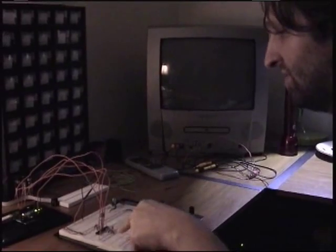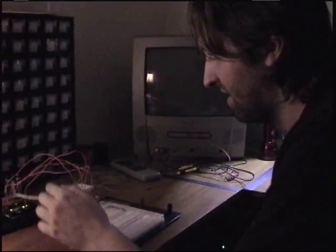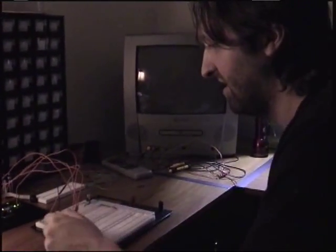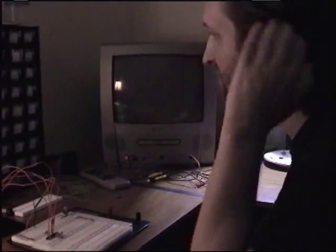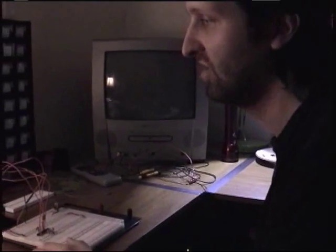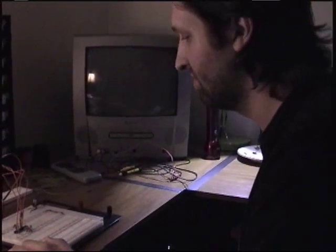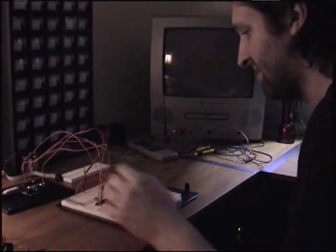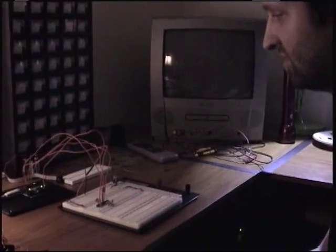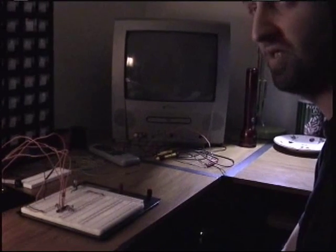Like I said, the issue with the reset pin is very important, because the first time I burned a bootloader, the pin went in after the leg of the resistor, and it didn't tell me there was anything wrong at first. But then when I put it into the Arduino and tried to upload a sketch directly to the chip, it had a "not in sync: resp=0x00" error. And I was like, well, what's wrong? Then I discovered that it was because you actually have to have it before the resistor. And so that's it. Thank you.